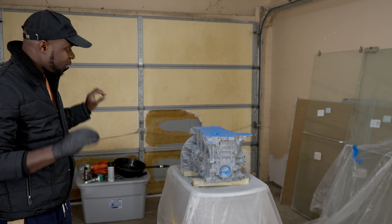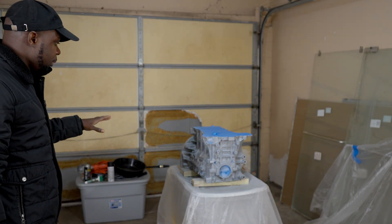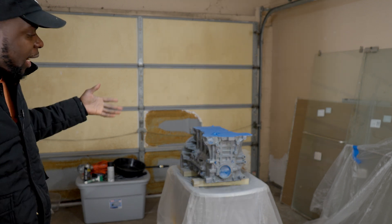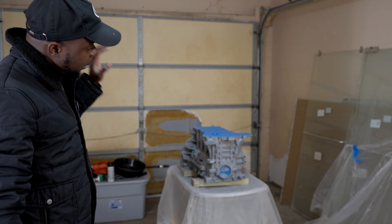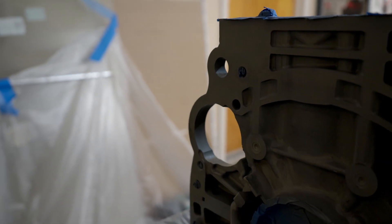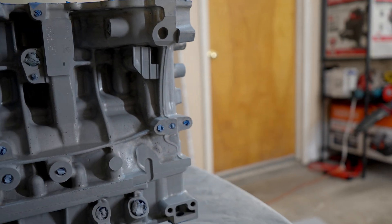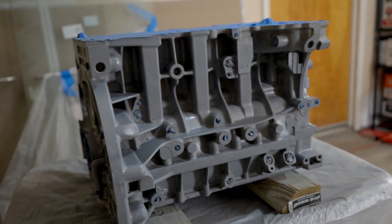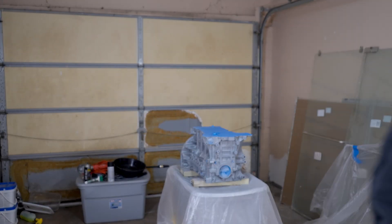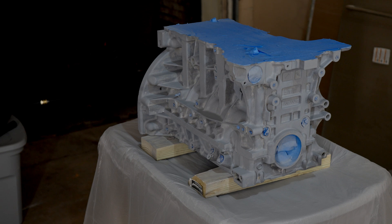I've applied the first coat — it's a very light coat. I don't want to go too heavy. There were some places where I oversprayed but that's okay. The instructions say to wait 10 minutes, then do another light coat, wait another 10 minutes, then do a medium coat. After that we wait about an hour, then apply the final coats, since this primer fully dries after an hour. Let's wait 10 minutes, come do another coat, and carry on.